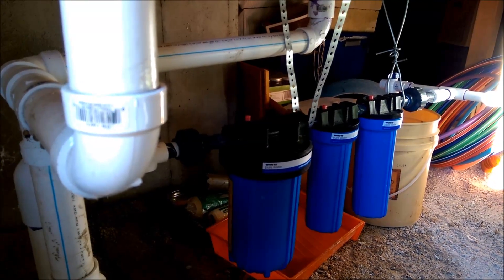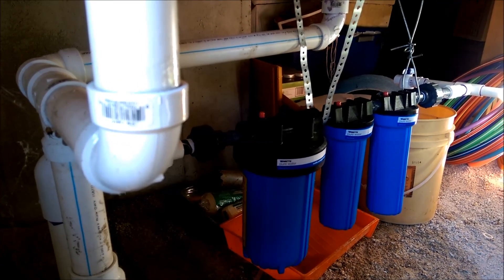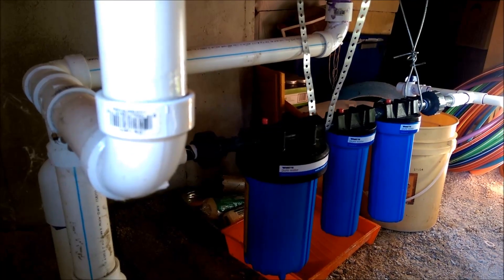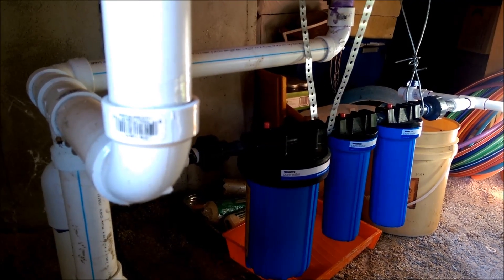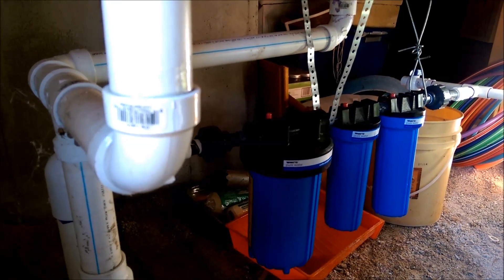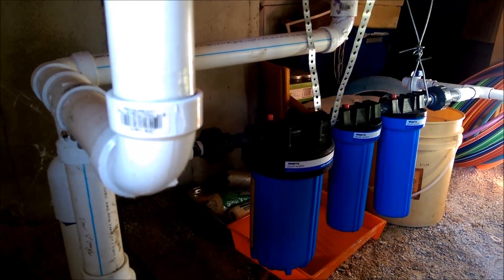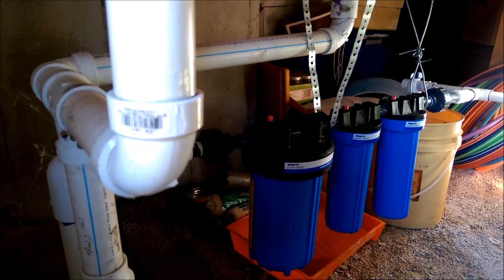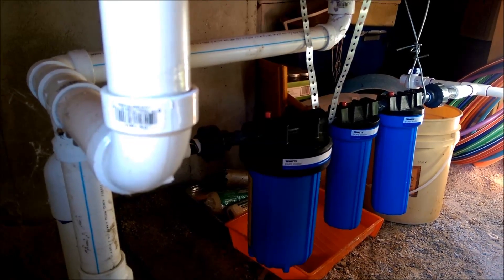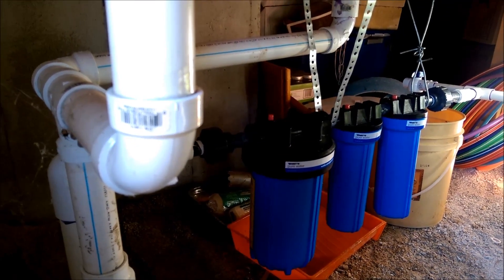The water coming out of the faucet has slowed down a bit. Something to note: the first time you use your system there's going to be dirt in the line, debris, stuff that was in the tanks — so the first time will clog your filters probably a little bit faster. I'm waiting until it really chokes down before doing filter maintenance, but that's going to be a for-sure thing. The dirtiest water is always the first time you run your whole system.